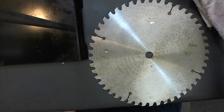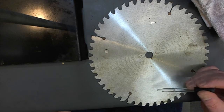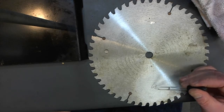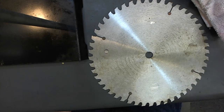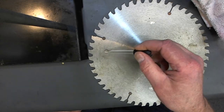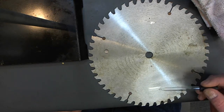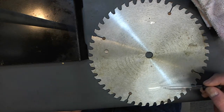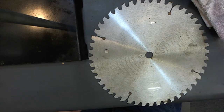Now we're going to take the eyedropper and the tap water and go one, two, three, four. You can see how much it's spread out. This first spot is still a real high round dot, but this one has spread out considerably. So this is a much better wetting surface because we removed a lot of the protectant.